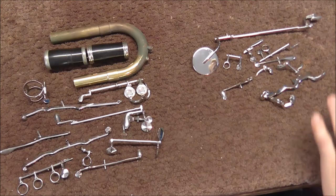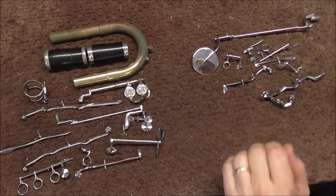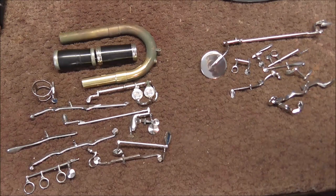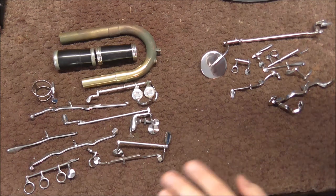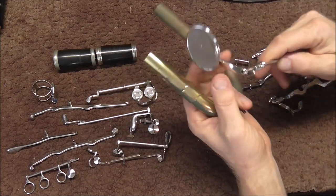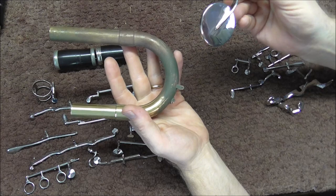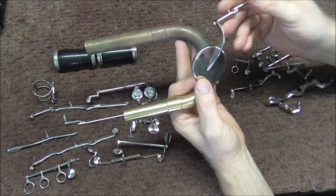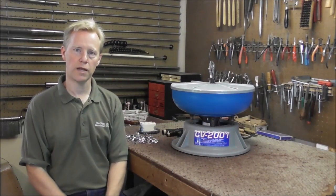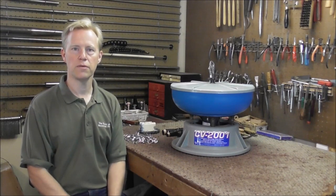After it's all done, here's what I came up with. These are the keys that are good — I just need to screw the flat springs back on. These are the ones I need to touch up by buffing, and most of them it's not too much — just a few spots. After spending the time buffing and touching up these keys, it will probably be about the same amount of time as using the vibratory machine, at least for heavily tarnished keys. On lightly tarnished keys the vibratory cleaner might be a little faster. For large parts, stop every hour or so and turn them around. After trying this machine, I think I'm going to stick with the buffing wheel and buffing compound, though I do think it would be good for people doing a lot of re-pads.